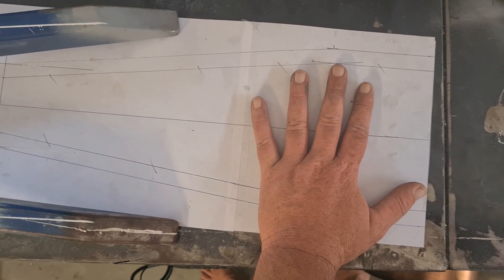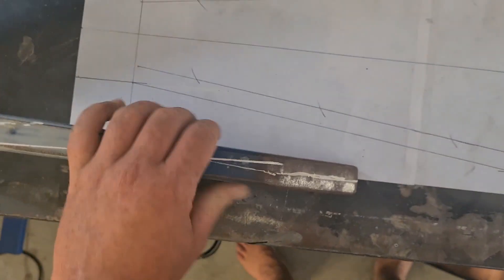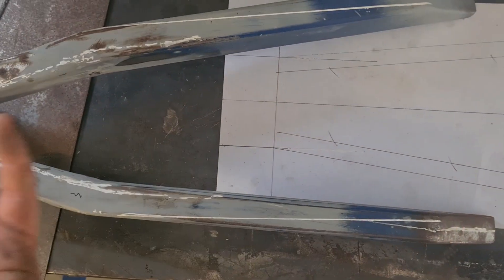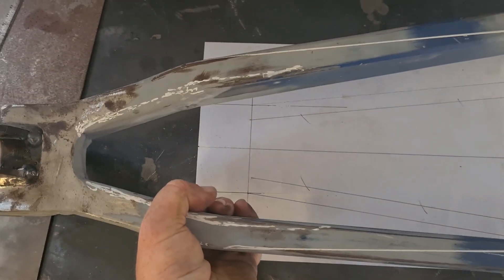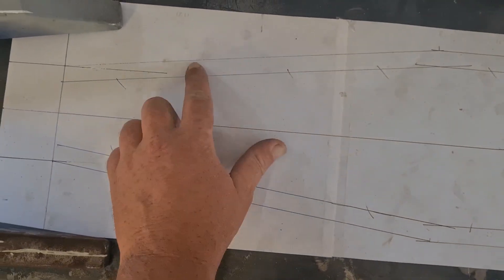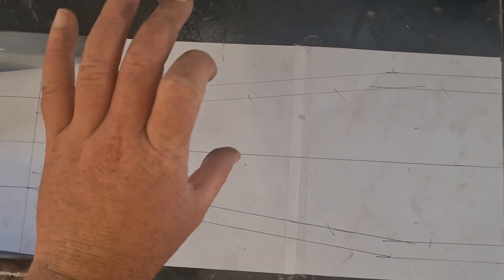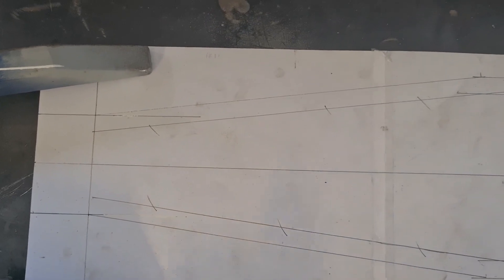I'll start with the top view and then build up the side views as well. Rather than using this — which is 50 mil by 25 mil RHS — made out of square box tube, which ended up relatively heavy — the plan is to use some smaller SHS square hollow section, 15 millimeter or 13 millimeter square tube, and make kind of a trellis, then skin it with sheet metal. It should look a bit cooler.